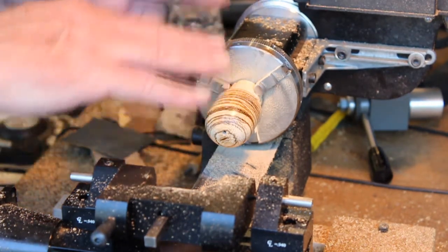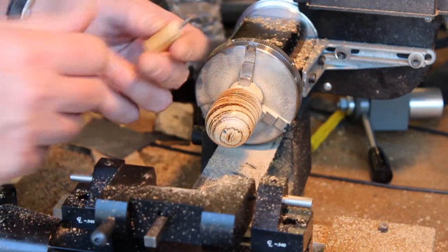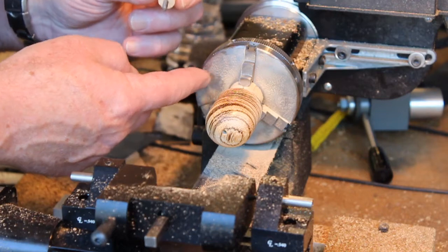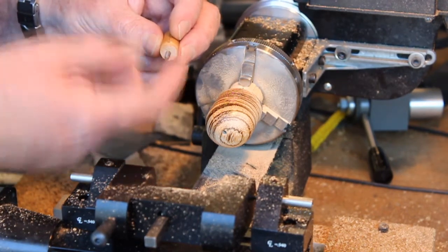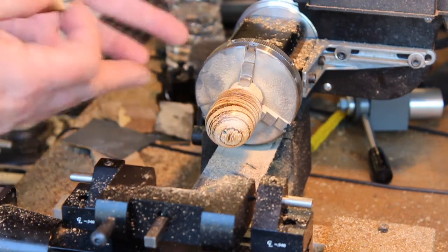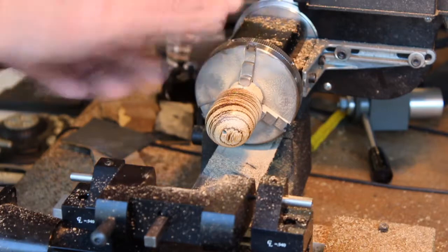The next step is to remove this from the lathe, cut this end off. To hold it the other way, I took a dowel, bored a hole through it, and put a sheetrock screw through it — this becomes my new mandrel into the chuck. Drywall screws have an incredible amount of grip, and the way the threading works, the turning will always be making it tighter instead of looser. The screw is going to go into the hole that we cut, which is why I wanted to get all this finishing done — because now it's going to flip to the other side.